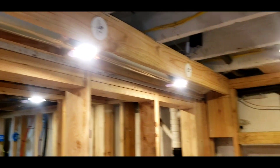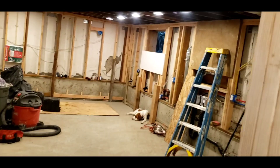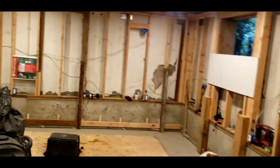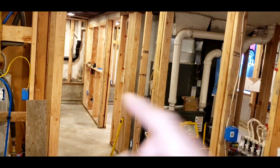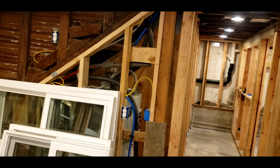All my lighting projects have these little soffit lights that came out really cool. All the heating ducts are in, the plumbing's all done. Stella's happy, the wife's happy, the kids are happy, I'm happy. I passed my electrical inspection — that was a doozy. It took me about a month to get everything wired in properly. It's crazy how the code changes. When I applied for the permit, there was a code change the very next day requiring 20-amp outlets to be tamper-proof. I didn't know that — I had to talk to somebody and they alerted me. It was crazy.